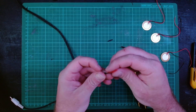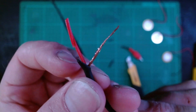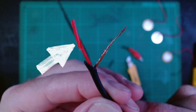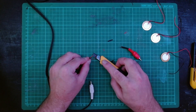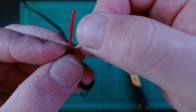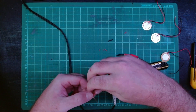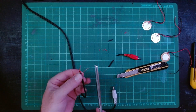The second wire you want is inside the inner rubber-coated shield. You'll need to slice the inner coating slowly until you reveal the wires. Twist each of the two wires to create two solid single pieces. What you want is to have enough of the inside and outside wire to attach them to the piezo disc wires.